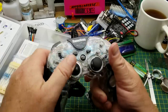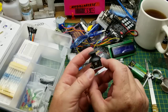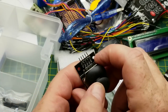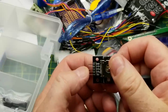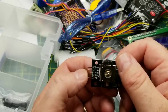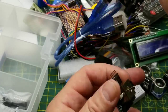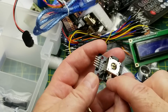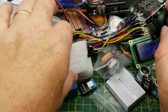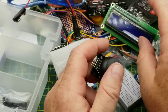We have a little joystick and its knob — very similar to ones found in typical game controllers. It has two potentiometers built in, one for horizontal and one for vertical, plus a little clicky switch button when you push down. For connections you have ground, 5V, variable resistor X, variable resistor Y, and the switch. Connect the two variable resistors to a pair of analog inputs on the Arduino — there are six of those — and the button to a digital input. You can create your own game or use it for cursor control on a display.